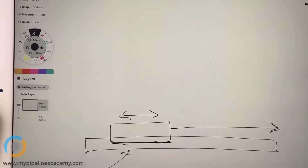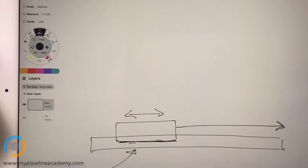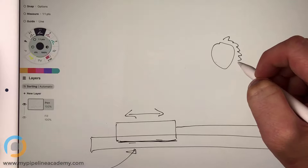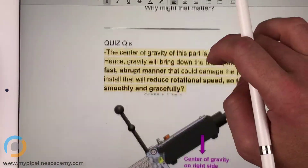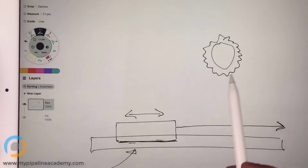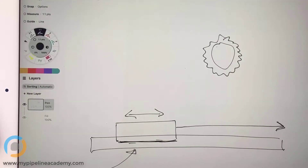The answer is you have to create a linear interface with your rotational damper. A lot of the common rotary dampers have gear teeth around them. So we have gear teeth that go around this damper — that's your rotational element. And then for the linear element, you could use what's called a rack and pinion.